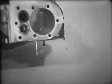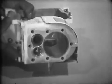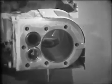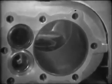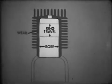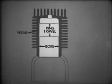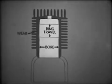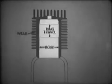The cylinder bore is measured for wear and for an out-of-round condition. We'll use a cutaway drawing to clarify just what we mean by wear and an out-of-round condition. The cylinder bore wears more at the spark plug end, or top, than it does at the bottom. This condition is called taper and is caused by a number of reasons.